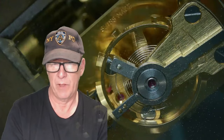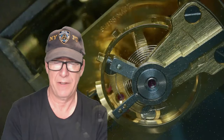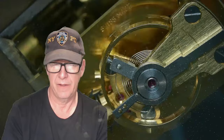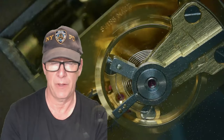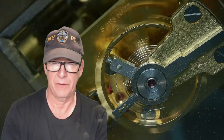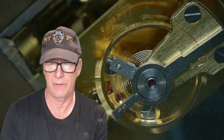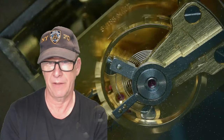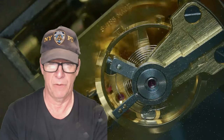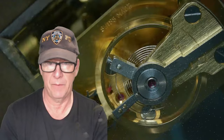The pins need to be as close together as possible without squishing the hairspring. I got it going but it didn't have the amplitude I wanted, so I found a Tudor Oyster Princess with the proper hairspring and balance and replaced them. The new hairspring was coned downward and I had to use my tweezers to adjust the coning so it would sit flat. Adjusting hairsprings requires a stereo microscope — doing it with just an eyepiece is a disaster waiting to happen.